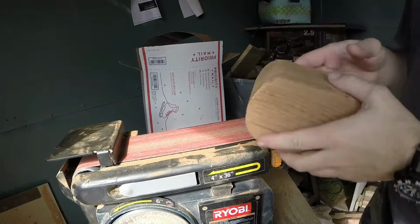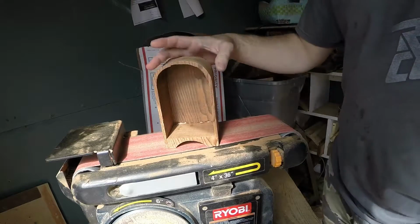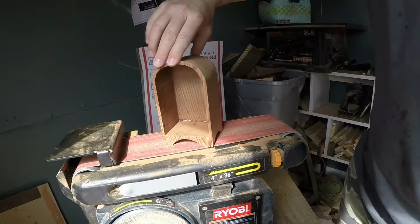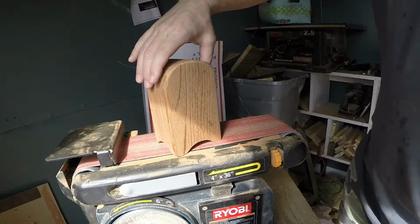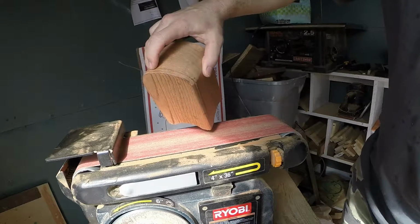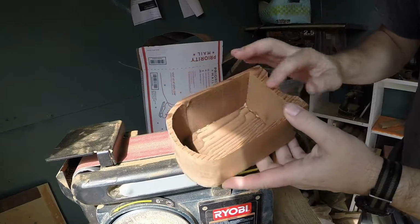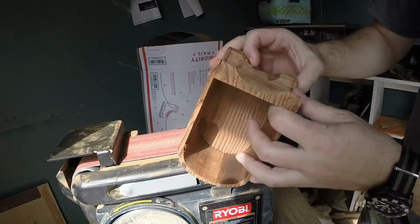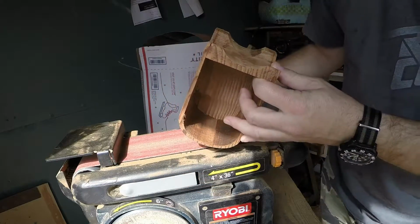All right, so we got our box here. This is the shell, the carcass. Let me do a little turnaround so you can see all the sides of it. Now, what we need to do is clean up all this glue on here. So we're gonna sand the sides, the top. We're gonna sand the bottom a little bit, get rid of all this extra glue that seeped out, and